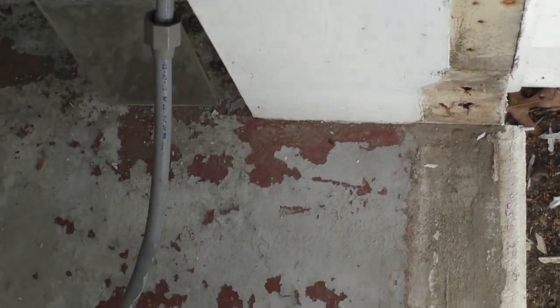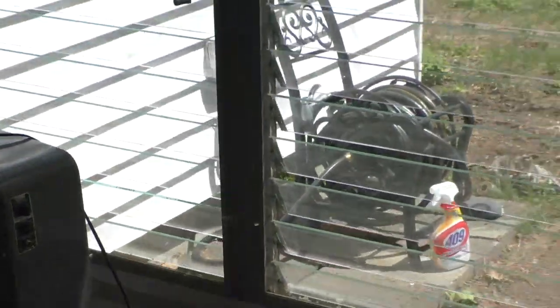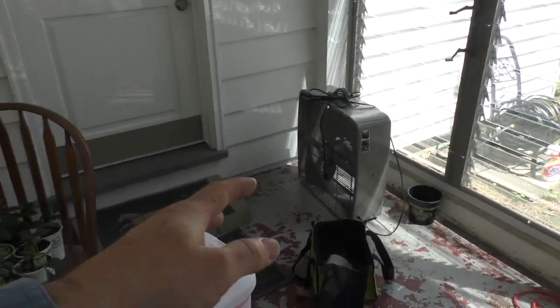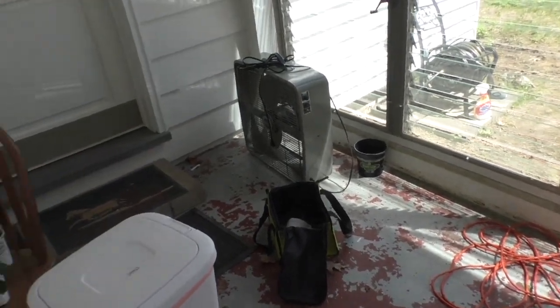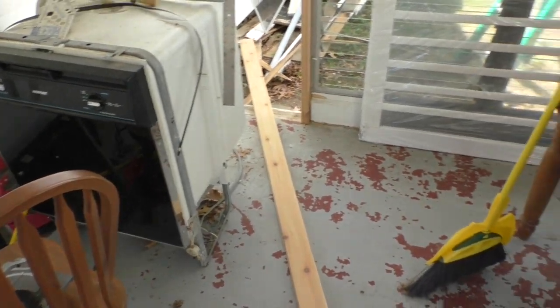Now, if you're building a house, you're not going to put the trim boards in and then pour the slab. No. You're going to pour the slab and then put in the trim boards. But the siding on the garage and the house and the trim boards go below the slab. So that means that after everything was said and done and the builder signed off on whatever punch list, they went ahead and they poured a second slab on top of the original. And that's about when they enclosed this. I don't know when that was. It could have been a year later. It could have been 10 years later. I don't really know. I tried pulling information on building permits and nobody had any information to find out when this was actually done. So what that means is there is siding in wood below the slab, like not under it, but you know what I mean, below the top surface.